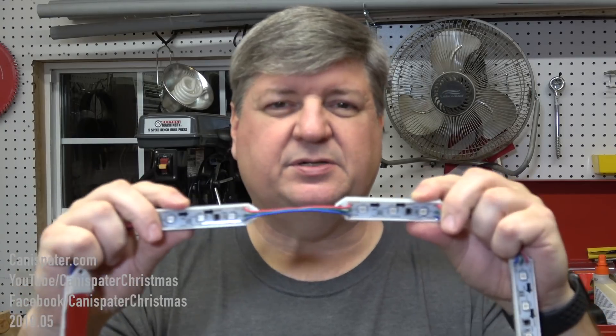For this prop I'm going to mount the pixels horizontally. The wall washer is made up of three ten-foot panels and the center panel is exactly ten feet. The other outer panels are a little bit longer by about an inch. I decided to start in the center and work my way out on the center board, which matches perfectly. Then on the outer boards I just have to match up where they touch the center board; they don't have to extend all the way to the end.